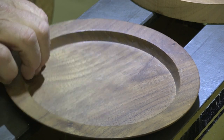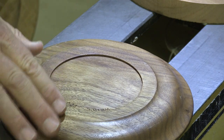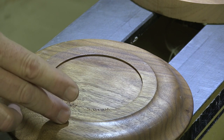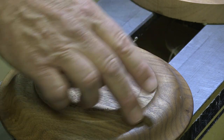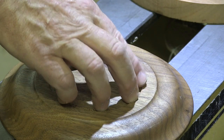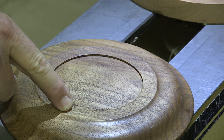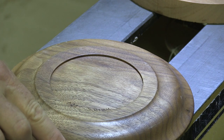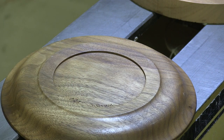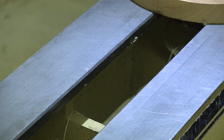And the bottom, in this case, I have kind of a two-stage thing. I start from the rim, I'm turning it ogee, and then I come to a kind of donut. The inside of the donut is where I grabbed it with an expansion chuck. I've come to the conclusion there's no reason for that donut. So these days, I come down and end the bottom right here. The bottom flows all the way across. I'll show you that in a couple of examples.